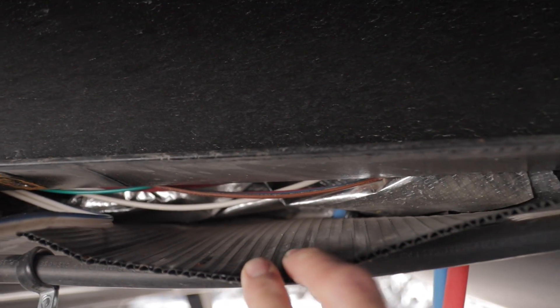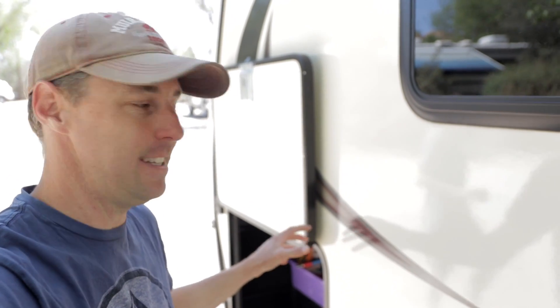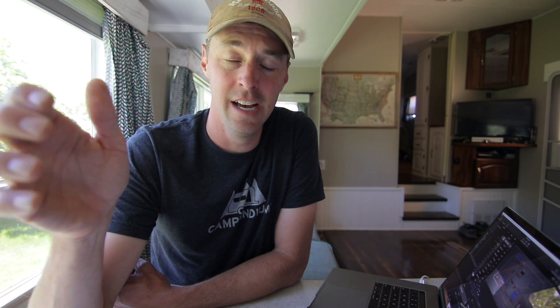When we installed it on the rig, it's not as easy as just drawing lines on a computer. We pulled the Coroplast down from underneath the sheeting underneath the rig and ran our wires, supported underneath there, to make our runs from the panel to the equipment near the batteries, inverter, MultiPlus, and all that. It was nice to keep everything tight in this bay — the inverter, charger, and batteries all basically right next to each other with the fuses and the disconnect — so all our runs are very short with no line loss. The wires we used were made by Mark at Premier DC Power — made from polar wire, which was super flexible and easy to work with. He crimped all the ends and heat-shrunk everything, which made it so much easier. The amp rating on that wire is outstanding.